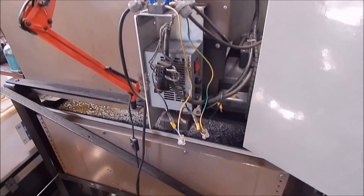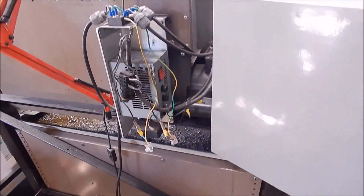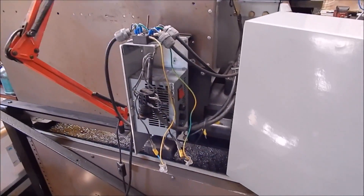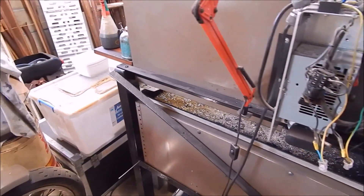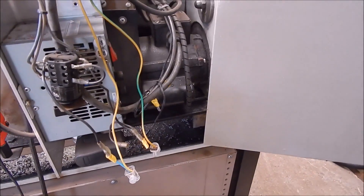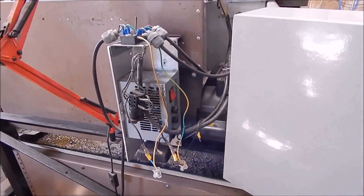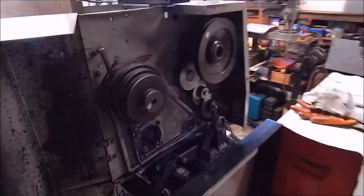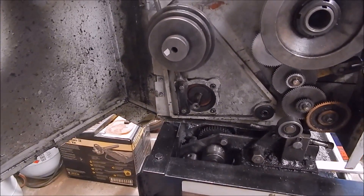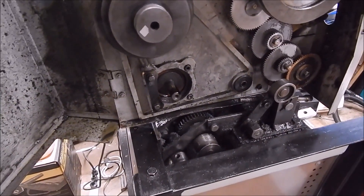I've made a bit of room to work around here — cleared the floor. I have to unbolt the rear chip shield and swing that out of the way to try and get the motor out, and I've got to take that crossbar out as well because it's a very snug fit. As you can see, there's not a lot of room in there, so space is at a premium on this job. Being an end-mount motor makes it worse; that's why I couldn't possibly reuse the fan on the treadmill motor — not enough shaft length, just can't be done.